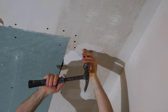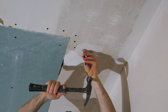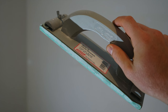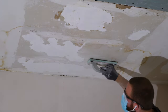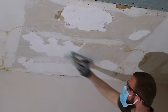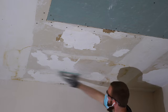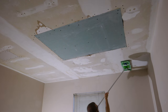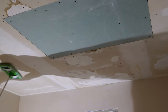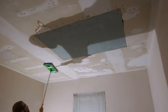Sometimes after screwing in drywall screws, it'll pull up the existing drywall slightly and the previous nails will be sitting a little proud — you'll have to hammer those home. Before mudding the joints, take a hand sander and sand any uneven spots on the existing drywall, such as previously patched areas or imperfect mud joints. Before applying any joint compound, make sure all dust is removed off the surface — I'm simply using a Swiffer with a little bit of water, which picks up all the dust really well.